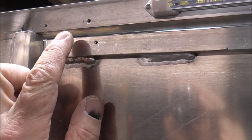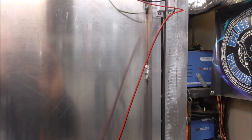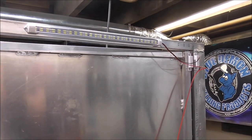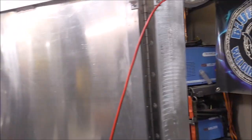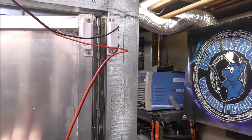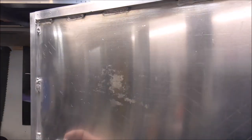Slight change of plans. I did not like this contactor here — I did not like that it was built out with that velcro, because I could picture when the doors open that this contact would get ripped off. So what I did was move everything over to here, and I think this is just a lot better. It's out of the way, it works better. Watch — open the door. It takes a little bit longer for it to turn on, but overall this is just a way better installation. It's less likely to get knocked and ripped off. So that's where we're going to put it.